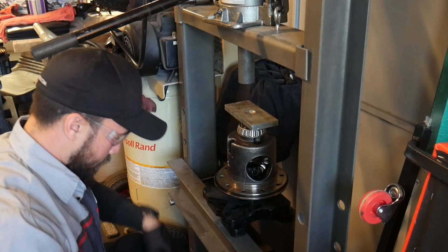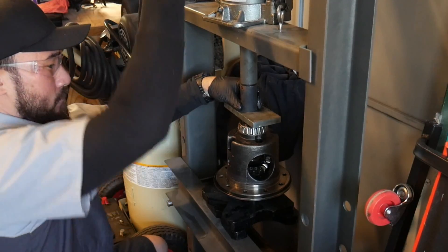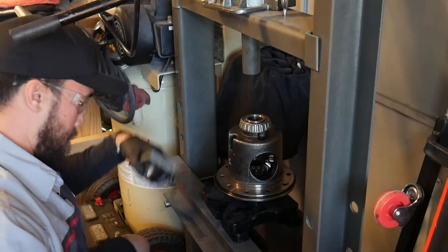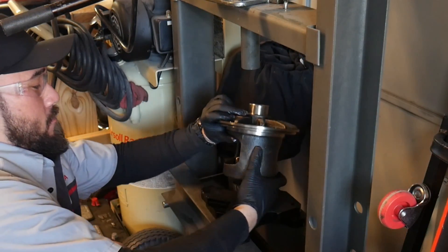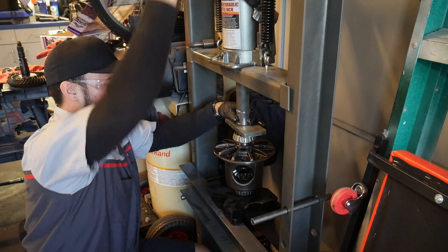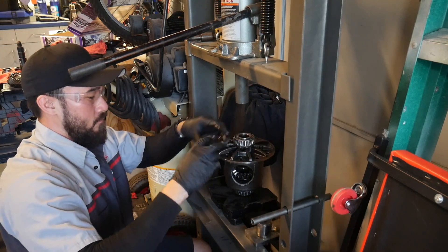You see me using that race right there — you have to use that old race to push on the bearing, on the part of the bearing that won't tear it up. I'm running through a bunch of different sized sockets because the press won't go down far enough otherwise. I do have a review video on that press — I think I got it for $120, and it's absolutely worth the money if you're thinking about doing any type of bearing work. While I'm pressing it on, I'm spinning the bearing to make sure it's not binding up and it's going on right.